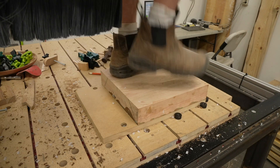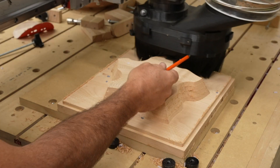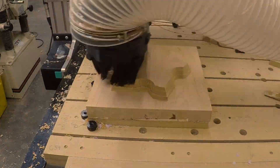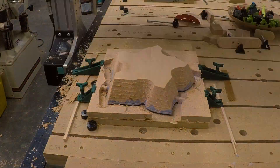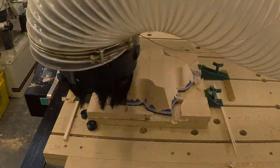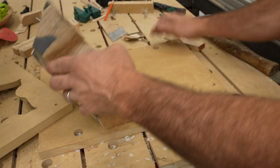It's really important that the double-sided tape is squished down really hard to get it to adhere properly. I temporarily clamp down the piece and remove the clamps immediately to get it really tight — I also sometimes just stand on it, which seems to work fine. I start the machining operation with a roughing pass using 3D Adaptive in Fusion and regular 3D roughing in Vectric VCarve. The Fusion 3D Adaptive with a three-eighths-inch spiral upcut bit removes a lot of material really quickly and is way faster than what you can get in VCarve. I then use a quarter-inch ball nose to do the finishing pass. To remove the bowl, I just use a wedge — I pound a wood wedge into the corner to carefully undo the tape.